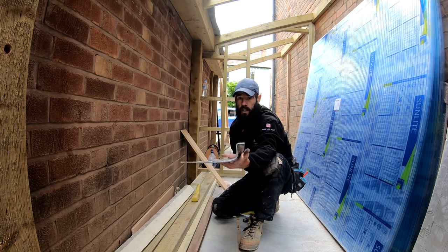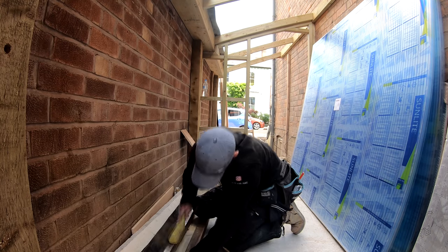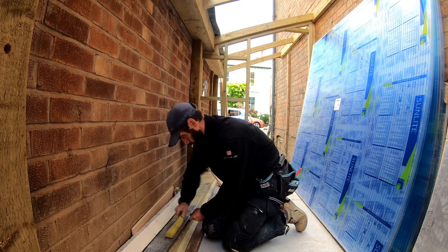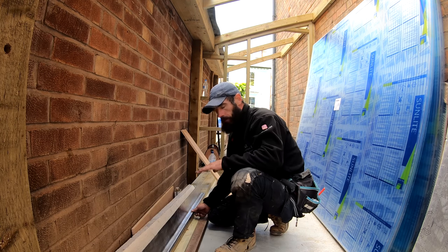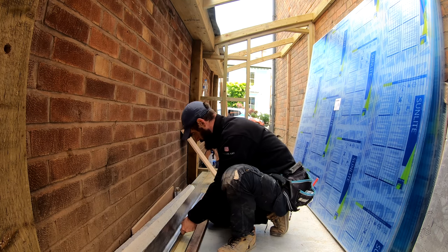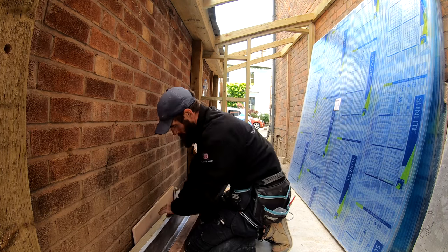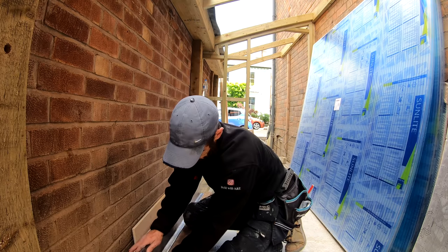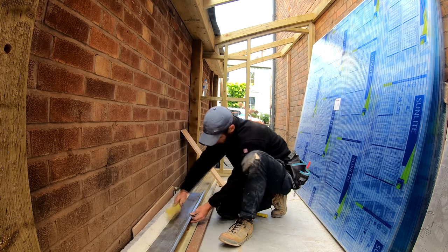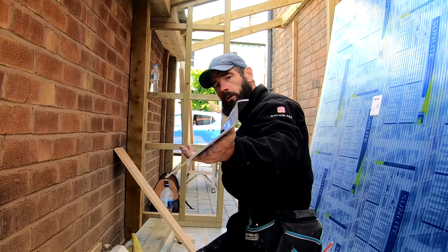If you look now, we're starting to get the angle that we want. It's not quite perfect just yet, but we're nearly there. So we've got our upstand and we've got our lip going into the coursework. Now we want to follow the angle — the 45 degree angle. So what I did was I cut a bit out of insulation giving me the angle that I need. We'll stick that there like so. There you go — if you look, we've now got our 45 degree angle on the lead as well.